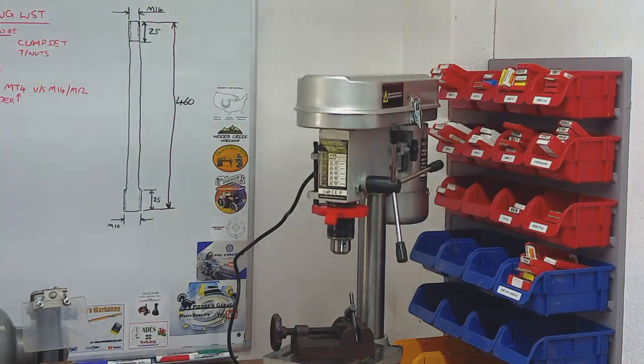So that's just a project that I've got for the lathe, and like I said, it is going to use the full sort of capacity of my lathe from tailstock to headstock, really, and it probably doesn't need the travelling steady, if I'm honest, because the surface finish of that 14mm bit in the middle really is unimportant, largely, because it's all in clearance, but I've got a travelling steady, why not use it? You know, it'll be an interesting setup. I've never used it before on this lathe, so it'll be interesting to set it up, and it might help somebody else who's got a similar type of job to show them how a travelling steady works. So, I think that'll make an interesting project.